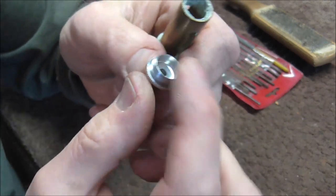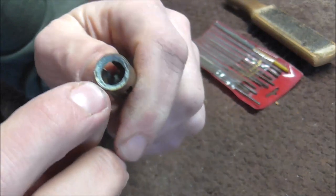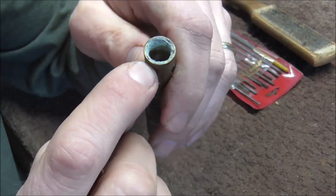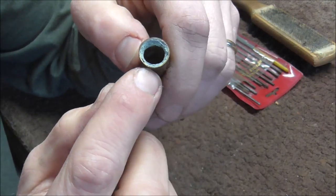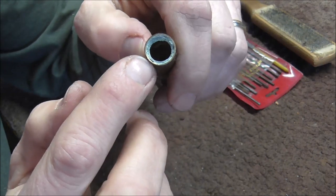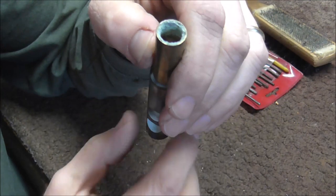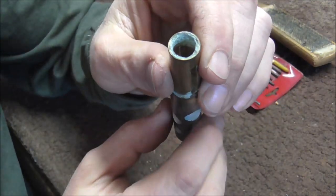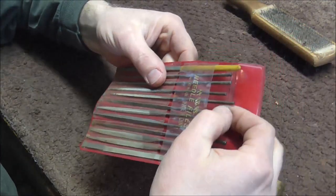What we have here is the bottom part of the valve stem — the threaded part. It is stuck in there and is very corroded. What happens with the corrosion is the metal oxidizes and that adds oxygen to the metal, so the metal actually becomes bigger. It gets stuck in the threading and you need to work to get that out. It will not come out easily. You also need to be very careful not to ruin the threading on the valve. So I'm going to start with a needle file.